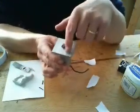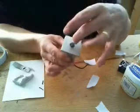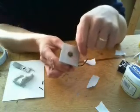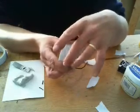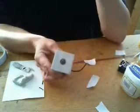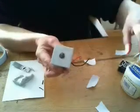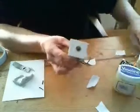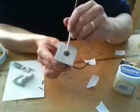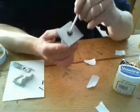Now you don't want the resin to stick to this and you don't want it to stick to the cog. You want to be able to pull that wheel back off and put it back on again. The splines in the cog will actually drive the disc round sufficiently strongly. And this second disc acts as a spacer so that when you've made the disc it's not going to drop down onto the mounting plate and hit it. Now in order to stop this resin, which will basically stick to anything, in order to stop it sticking, what you do is use a bit of Vaseline. So just get some Vaseline, smear it on that top plate, and then with a stiff bristle brush go up and down the splines of the cog to make sure that you've got the Vaseline all over there.